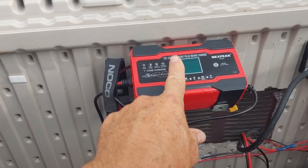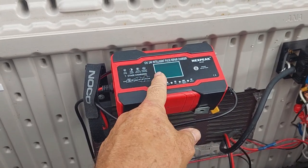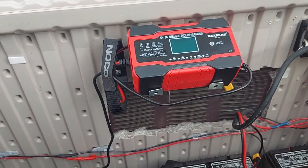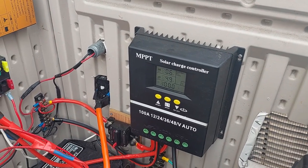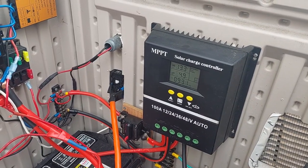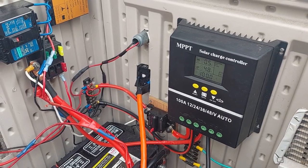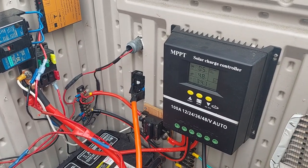The display wouldn't pull a whole lot, but there would still be a slight drain with the charger on — and I didn't like that. I started focusing back on the solar controller, and after I remembered how to get into the menu and did some research, AI advised me to raise the high voltage absorption for the kind of batteries I'm working with. And doing so, it worked pretty darn good.